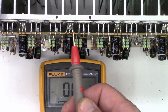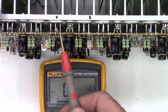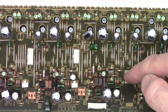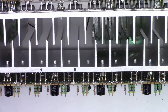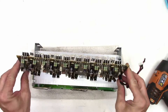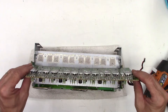This is a bias current regulating transistor, which is why it's on the heat sink. With transistors, as they heat up and cool down, their gain changes ever so slightly. With this type of amplifier, you want to keep each transistor barely biased on. We can gain access to all the power transistor screws right through these holes here, and it's got a couple of other screws — so I don't have to unsolder every single one of these transistors if we can pull the majority of them off the board. They certainly came off easy and seem to have adequate heat sinking compound on them.